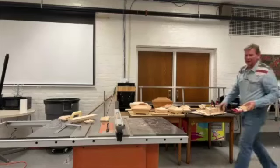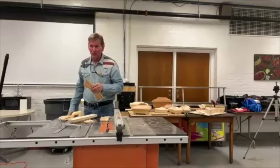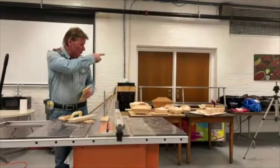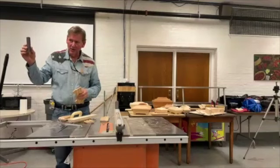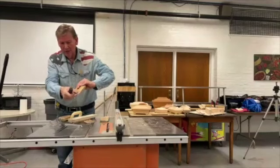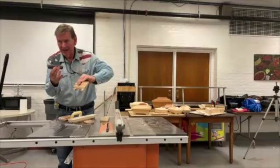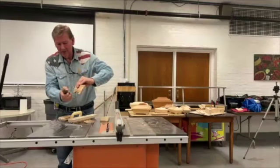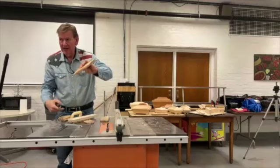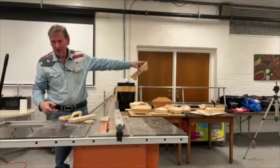At this point, before cutting that slot, generally what I'll do is cut my legs first because I don't have my bandsaw or a scroll saw here. I cut a sample. I just take whatever sander I'm using, the oscillating sander, or I can use a drill press, same thing. I just draw a circle. I draw a line up for how far up I want to go, which is a little more than half of the diameter on this. I draw two circles with this blank, cut it on the bandsaw. We're going to refine it on the oscillating sander.